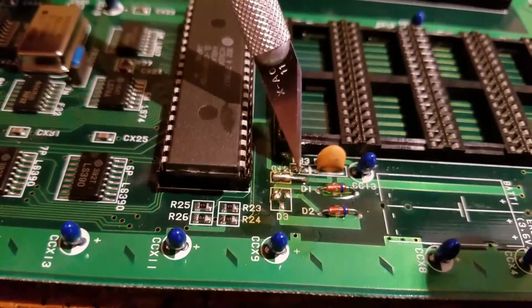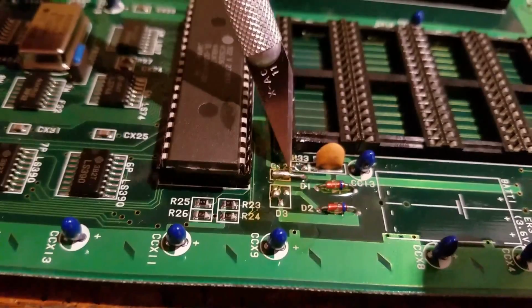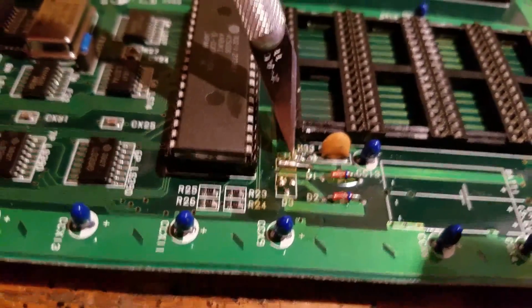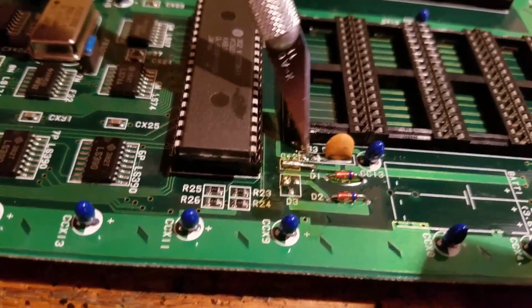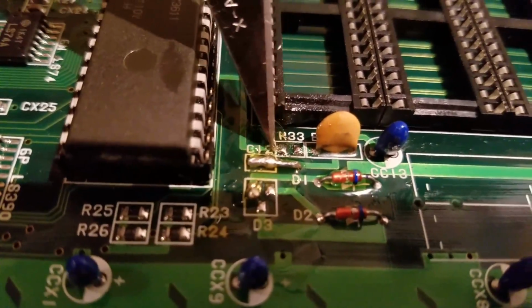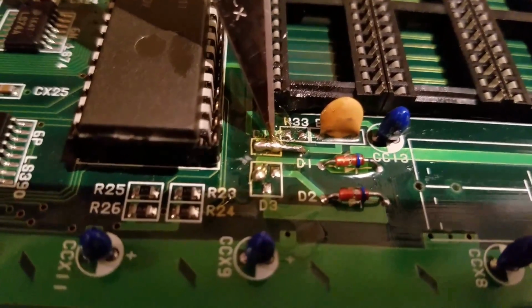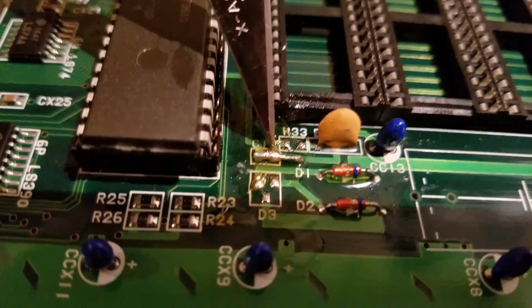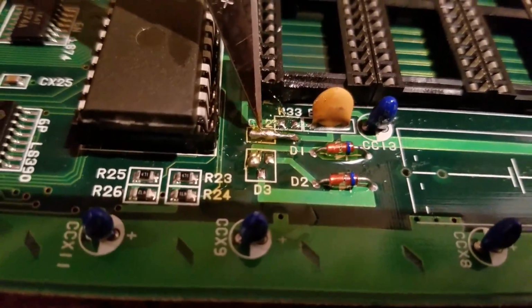And what you want to do is put a little jumper in there. I made this a little longer, but a little jumper. So where that capacitor was, you put a little jumper in there and connect those 2. Alright, so the R33 is out. You leave it out. See how it's out? There's no R33. I'll clean up the flux later. And then the C12, you remove the capacitor, and then you solder in a little jumper. Alright, so there's no capacitor, just a little jumper.